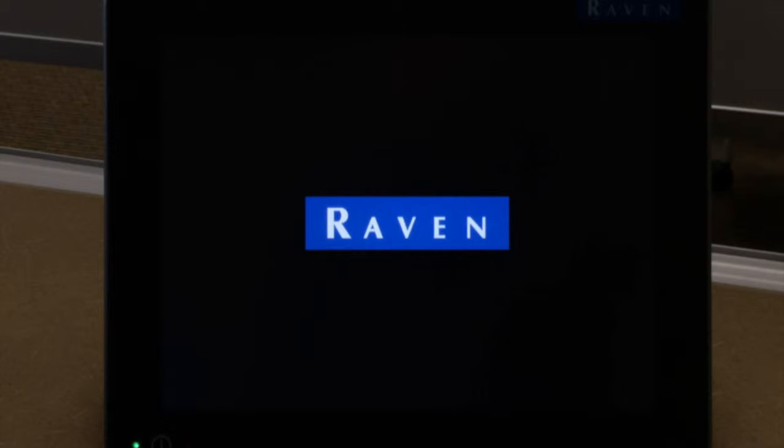Welcome to the Viper 4 customer programming for your R4900 model planter. The display is currently off, so our power button, which is located in the lower left hand side, if you just press it once, the Viper 4 will power up, and we'll move on with our first setup component, which is entering in our GPS receiver locations for your specific tractor receiver.